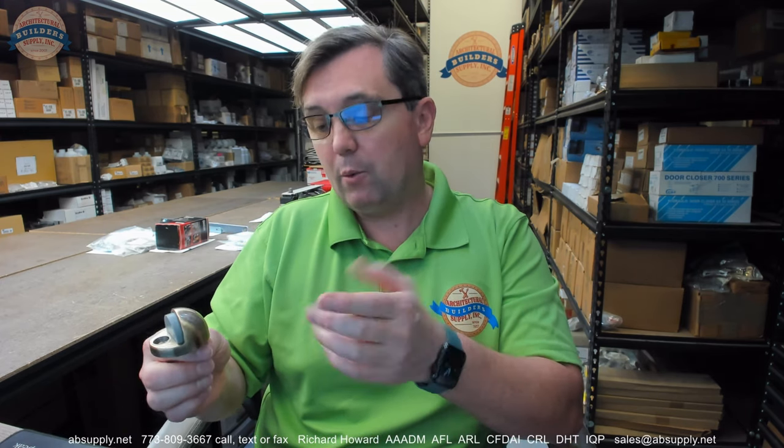The US system tells us this would be US5, antique brass — but it doesn't tell us the base material. Fast forward a couple of decades: BHMA said the US system is good, but it would be better if we knew the base material as well. So what is the finish code for antique brass when made on a steel base? Maybe 635?